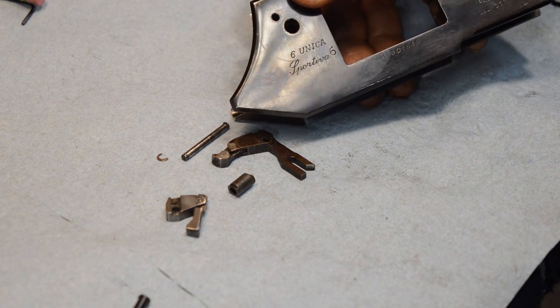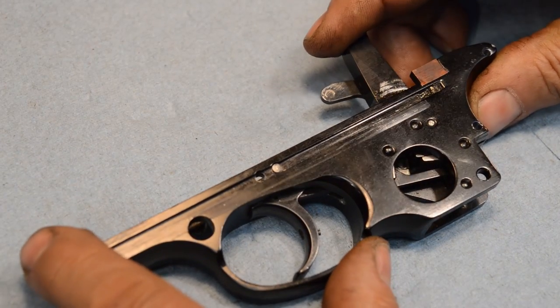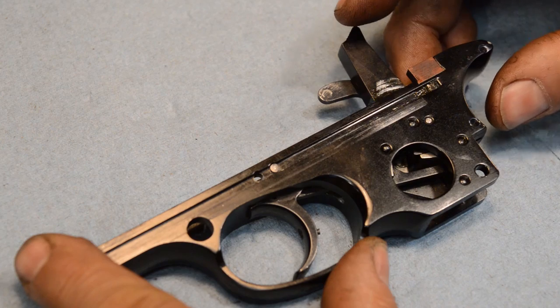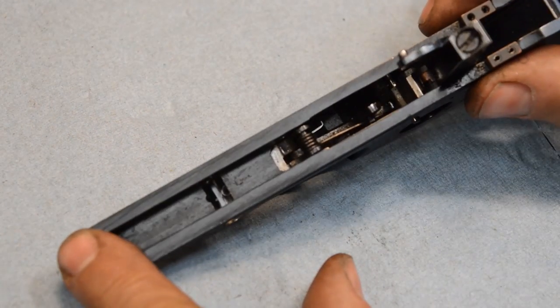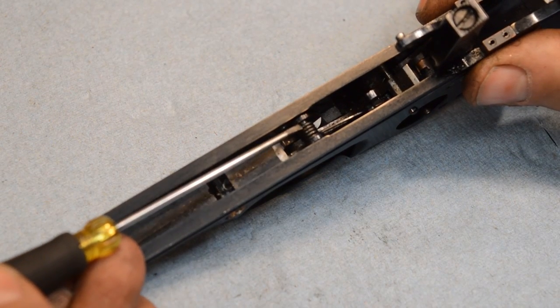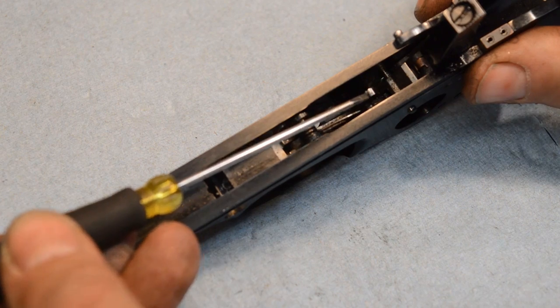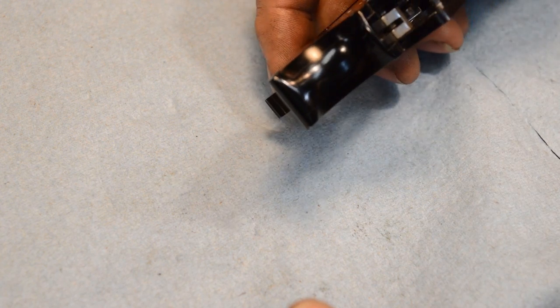When that's mounted in the gun, this strokes up and down — this spring-loaded part right here is the hand, stroking the cylinder. All this is hung off of this cross rod. As this moves, the torque tube brings the torque over. That torque tube, when moved by the frame, carries this over and moves this piece back and forth. It drives that up and down. It is a complex little bugger, but it's starting to make sense. There are three rather gargantuan springs: the main spring up inside the hammer, the trigger spring, and the sear spring.